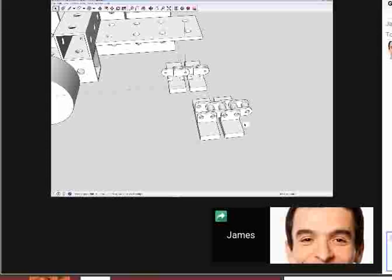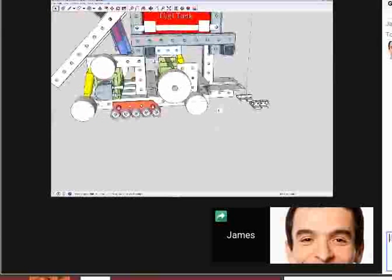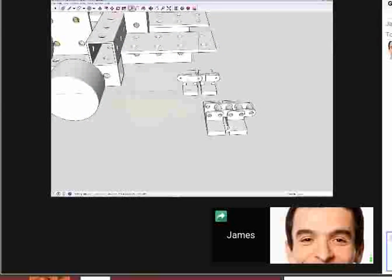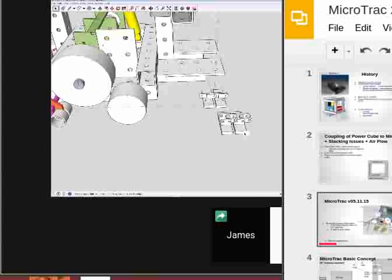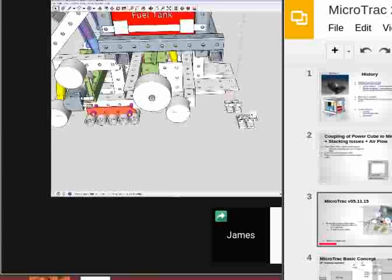But I guess the track. What you're doing there is probably making the tracks short enough that they wrap nicely around the small sprockets, right? What we should probably do is enlarge the sprocket size so that each track piece, I would say something like 4 by 6 inches would be the right track dimension, more or less, because what you're drawing is probably more like 2 inches. I would say enlarge the sprockets, make track pieces 4 inches. I don't know, the scalable track, we'll give up that idea for now. We'll worry about that later, once we build the first one.